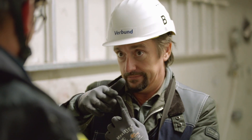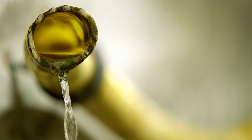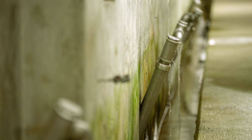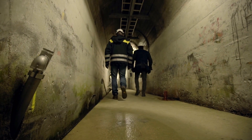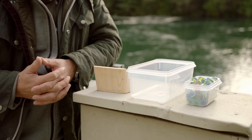So if it lifts it — if the uplift pressure is too high — but it isn't. The reason it doesn't topple over is down to taps: 600 of them positioned throughout the base of the dam. So I should be glad that it's leaking. Yes. I can demonstrate this uplift. Thankfully, I've remembered to bring a bit of wood, some marbles, and a Tupperware box with a hole in it.